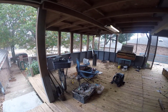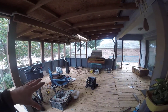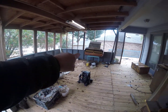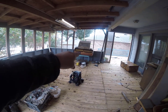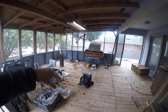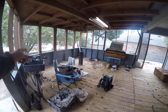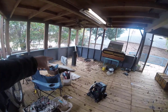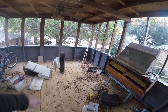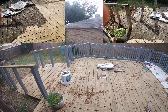All right, so the inside of this, I guess I'd call it the cover over my deck. I replaced all the wood around there. I had used paneling before, and I went and got some house siding, and painted both sides and the edges before I put it up there. The other stuff looked really bad, and then I painted the wood, and I had to replace some of the wood down there on the bottom because it rotted out. And then I'm also going to have pictures of before and after.